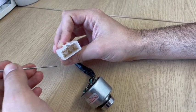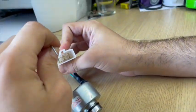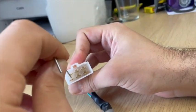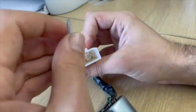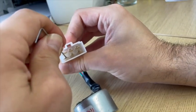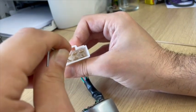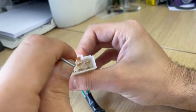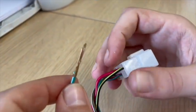Just a quick video to show you how to relocate these pins. When you look at each pin there's a little locating tab. What you're going to do is use a small allen key — something small with a bit of strength — push the tab flat. Once it goes flat, sometimes you hear a click. You can just give it a bit of a push and it will pop out. And there you go, one wire ready to be relocated.